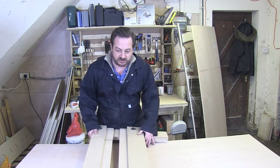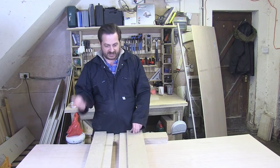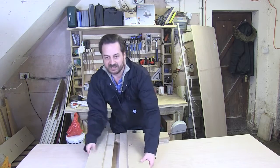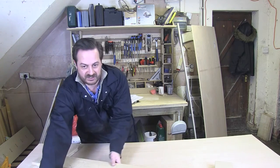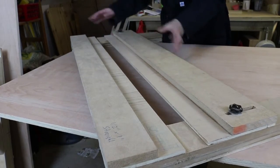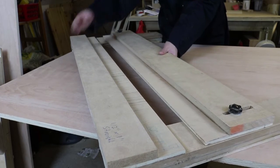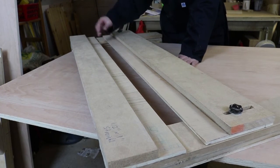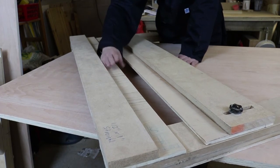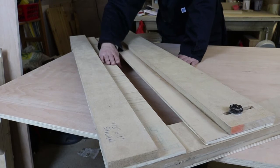I'm going to have to do something else rather than use this jig, but let me show it to you while I have it here. This is a design taken off the web — how to make the perfect dado rails. We have a fixed fence here which is 90 degrees on these two supports. This part moves backwards and forwards and can be tightened up. This overlay here is perfect for the router to hit against and drop a half-inch bit, which will just clear it and cut with the half-inch bit.